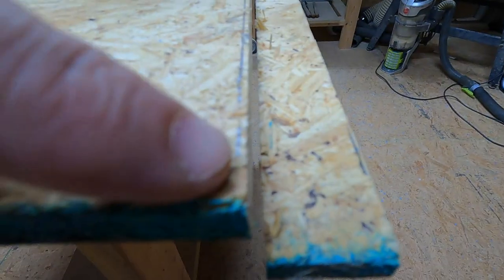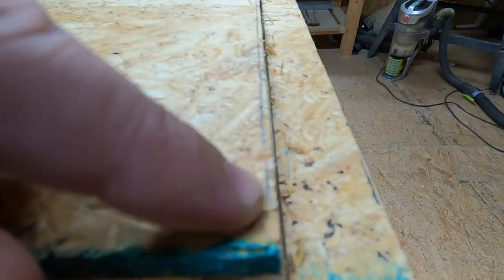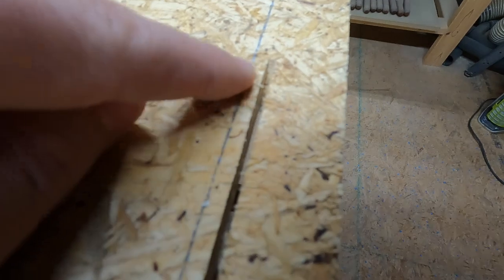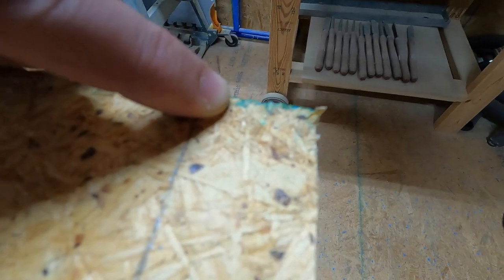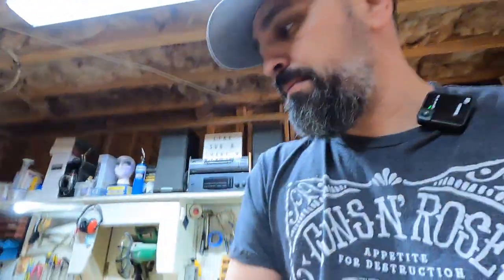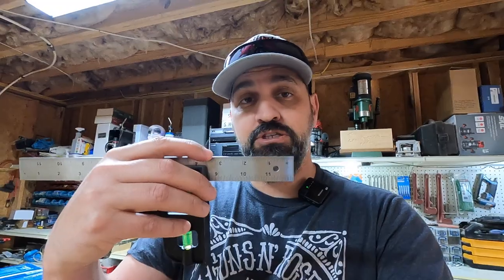So I'm going to show you a line that I cut and how far off this thing got. Right here was the line that I wanted to cut using that track saw, and you can see it started off a little bit weird. Watch what happens when I got way up in this area — it was so far off that it wasn't cutting straight. I'm like, what is happening? This was not going to work. By the time I would have got to here, I probably would have cut way over here. It was cutting at an angle, dragging along, and it would not cut straight. I ended up measuring from the front of the blade to the guide, to the back of the blade of the guide, and it was just so far off. I had to return it. It worked like one time, and then after that it was garbage.